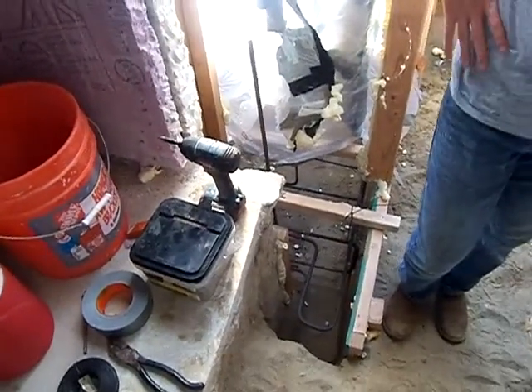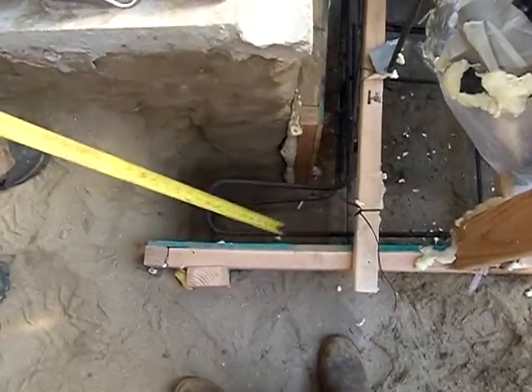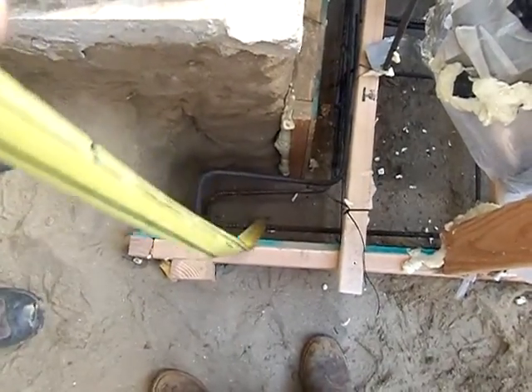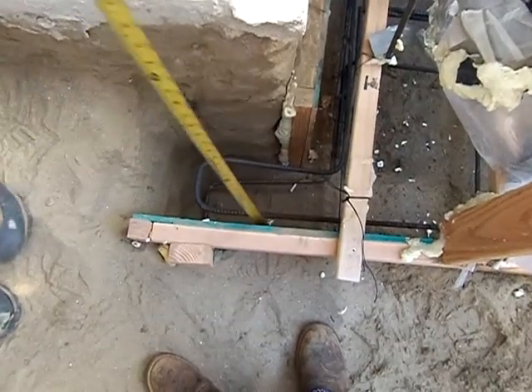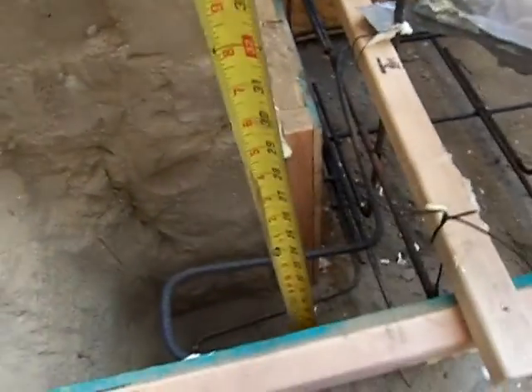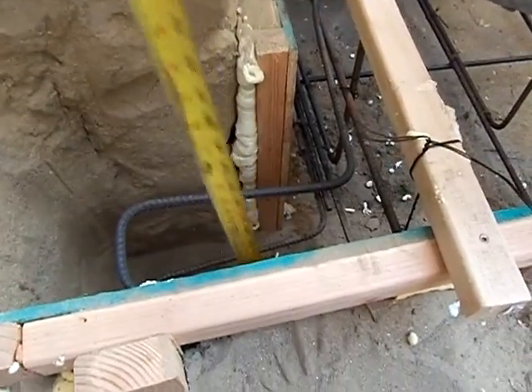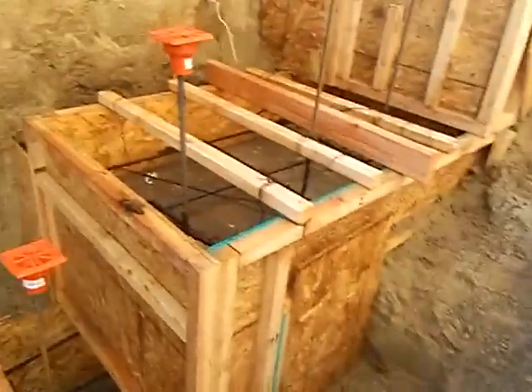I'm documenting the rebar position in my footings. I'm gonna give you the camera, Morris — you just follow me around. Let's start right down here. This footing is 20 inches deep. Can you see my tape right on the footing there? We're about 20 inches deep. Okay, let's walk outside, Morris — walk up the ramp a couple steps.